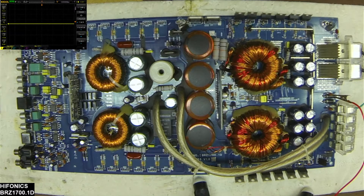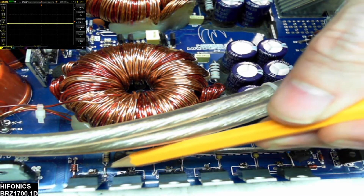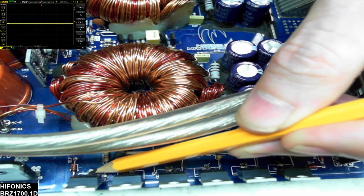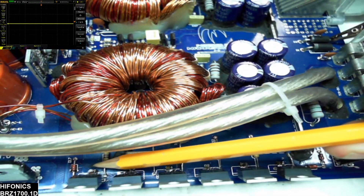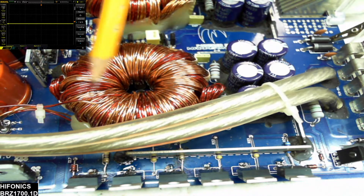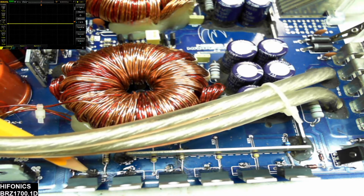On the camera you'll see that what I do is I run a copper jumper through the board, wind it around the back side of the transistor leg, bring it back up, and solder it to the board. These are real hard traces to repair — there's a lot of current that's got to pass through these.